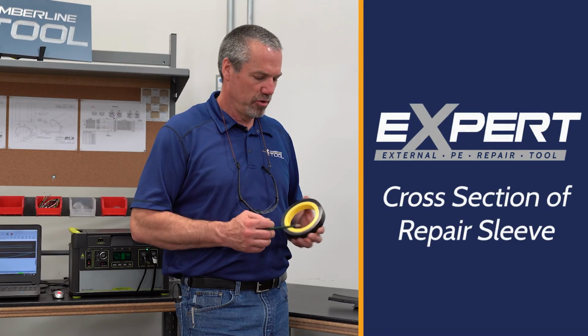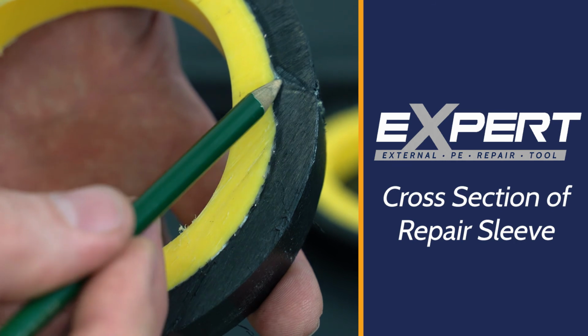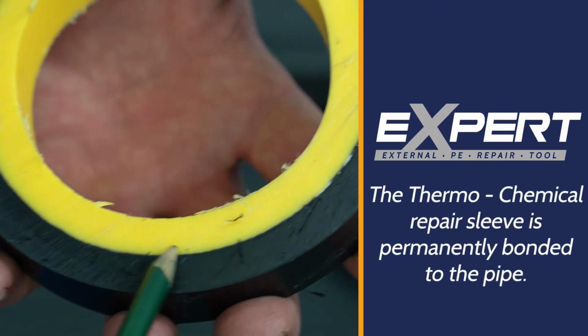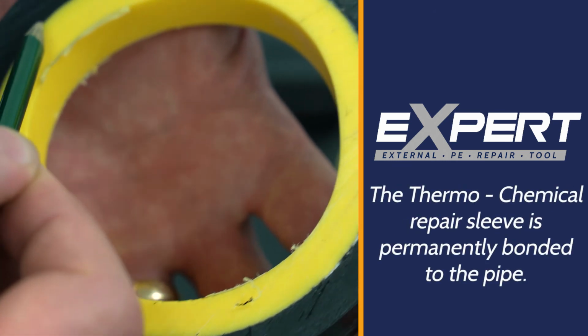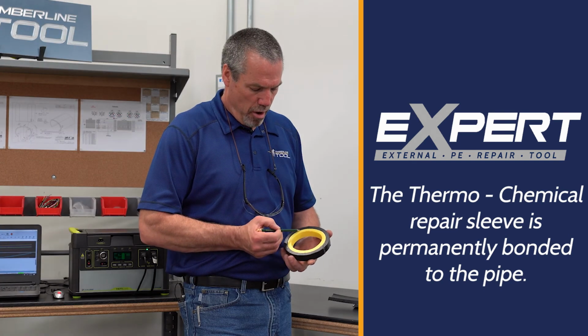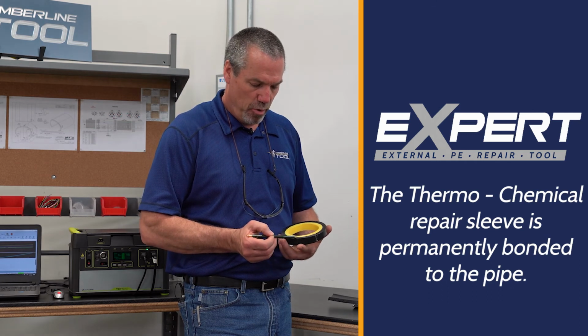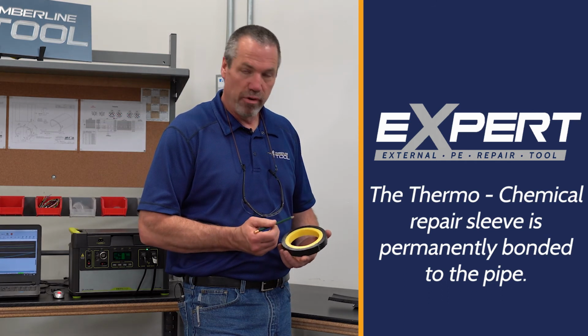Now that we completed the application of our repair sleeve on the pipe, I wanted to show you some cross sections of some other samples we've created. Here is the seam where the repair sleeve came together during the bonding process. I'm also looking at the joint of where our sleeve and the pipe are together. There's no gaps, it's clean, and it's very uniform.